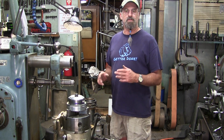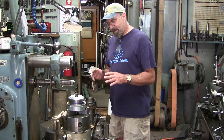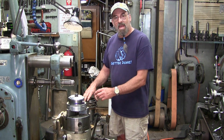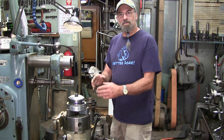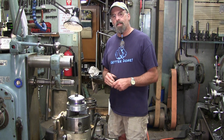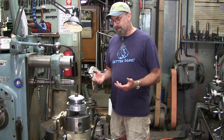We have broken loose our dividing head from the Bridgeport and we brought it over here to the K&T. Our project on the K&T is to set it up and cut the one slice in the middle that will break loose the slit line that we just finished milling over at the Bridgeport. We want to do that before we actually pull this off of the jig.